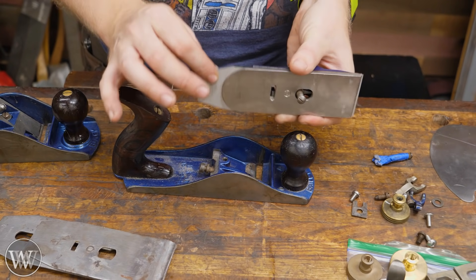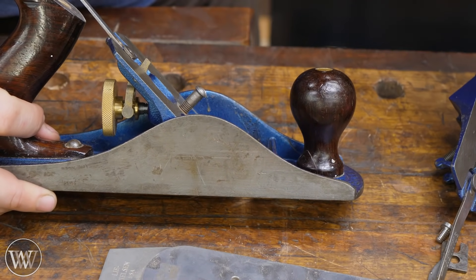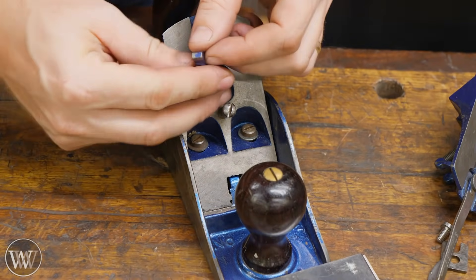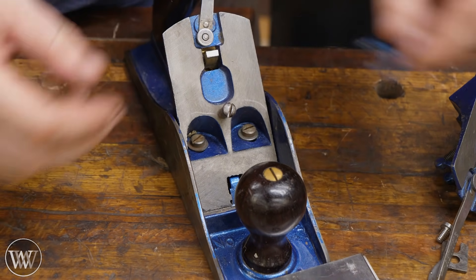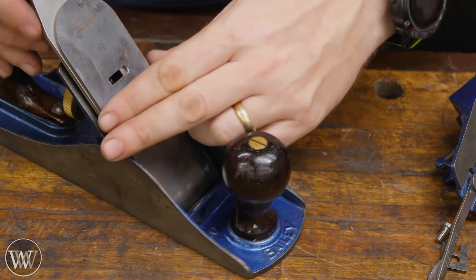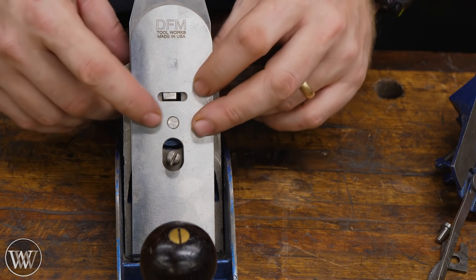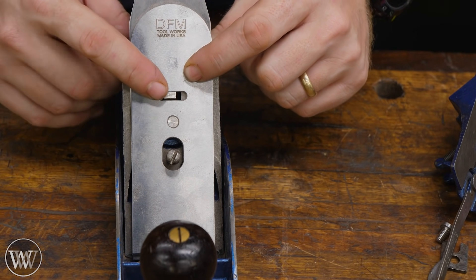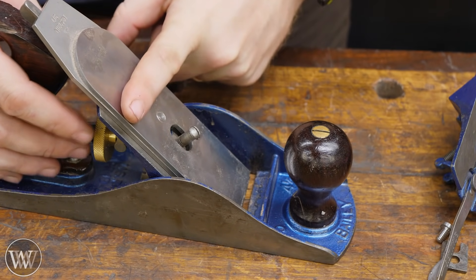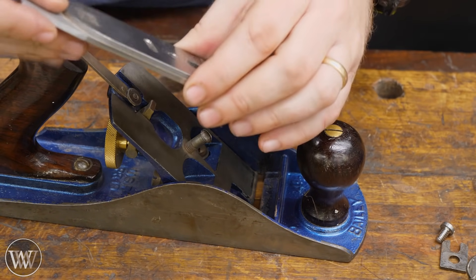Finding the right adjustment really depends on the thickness of your iron, and every iron is a little bit different. So Jeffrey came up with a new yoke — it's exactly like the original yoke, except the end is considerably longer. It's also a little bit beefier so you don't have the original thin stock. It's a little bit wider so it will connect with most of the full width on the chip breaker, and it's long enough that it can go through and into the chip breaker. He's making them long enough that all you do is take a file and file it down to the thickness of your chip breaker, so you can have a yoke that exactly matches your iron and chip breaker set.